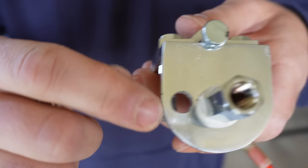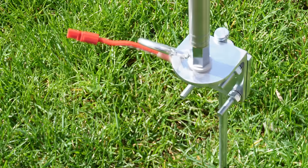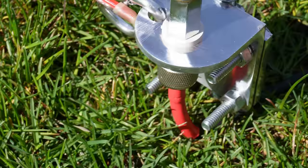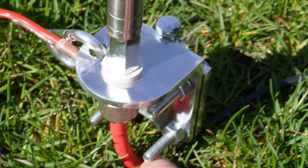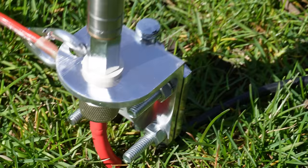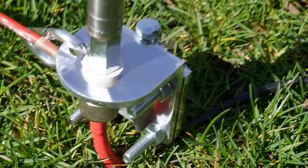After drilling that hole I got some sandpaper and smoothed it down so I don't cut myself on any metal shards, then clipped a carabiner into place — voila. One thing I want to point out: the coax comes straight down and bends when it hits the ground. Those bends aren't good. You could get an L-shaped adapter or an L-connector, because that bend can really affect your SWR and impedance values.